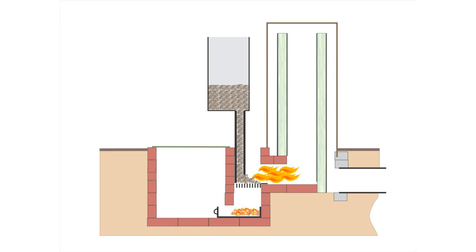There were also two major issues with this design that I discovered. First, by having the feed hopper in a vertical position, the supply barrel was too close to the hot barrel and it got far too hot. Second, as the hopper emptied, the remaining pellets would start to burn at the base, and the fire would start the draft back up through the feed hopper.